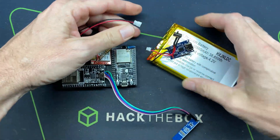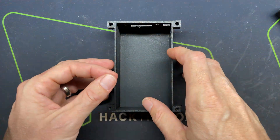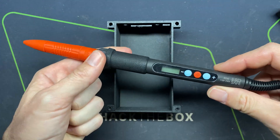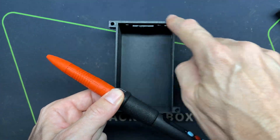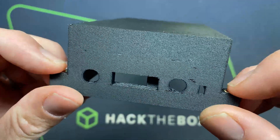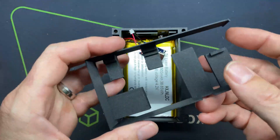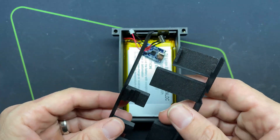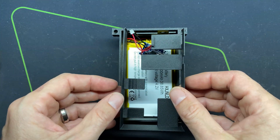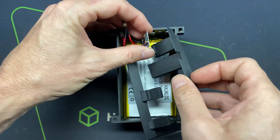I'm going to unplug this and now we'll begin getting the case ready for the final install. To start prepping the case I'm going to use two of the M3 inserts and a digital soldering iron to melt them into the top receptacles. Now with our M3 inserts melted in, the next step is to put the battery back in. Now we're going to start on the gasket — this thing is incredibly fragile, extremely thin; it derives its strength from being forced into the bottom of the case.